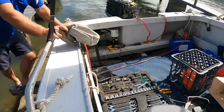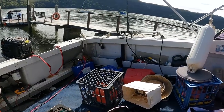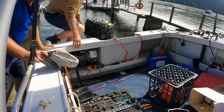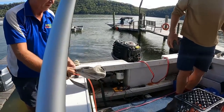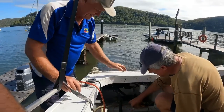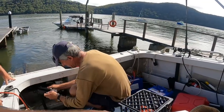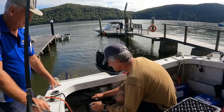The battery's on charge and has been for a while. They've also tried a second battery — tried several, in fact, and got nothing. They've just pulled the isolation switch out. One thing the guys did recently was put jumper leads from the battery straight to the starter and it worked, so it's obviously something in between.